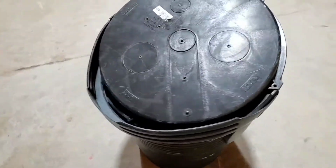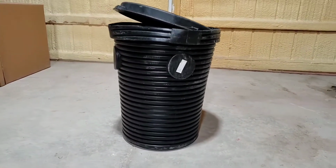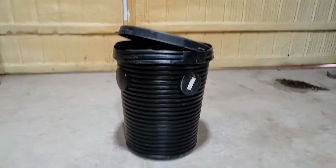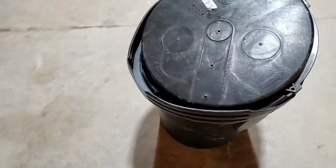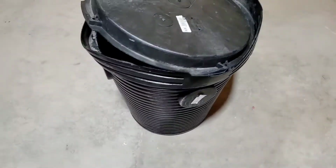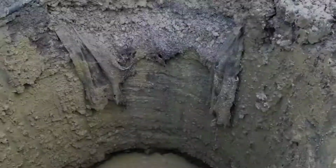It's really intended to have cement poured around it because it's really, really thin. It's very flimsy, and it has no strength otherwise. It has no UV protection. This will break down in the sun. That's why you see guys tucking these real tight to the house so that the lawnmowers can't run over them and they can't end up with any foot traffic, nothing. Matter of fact, they try to put them in the shade because they have no UV protection.